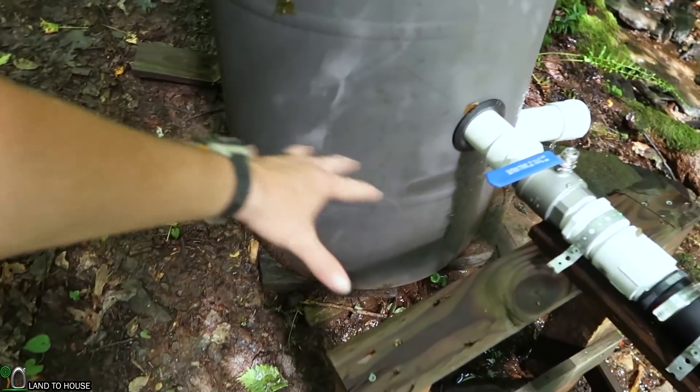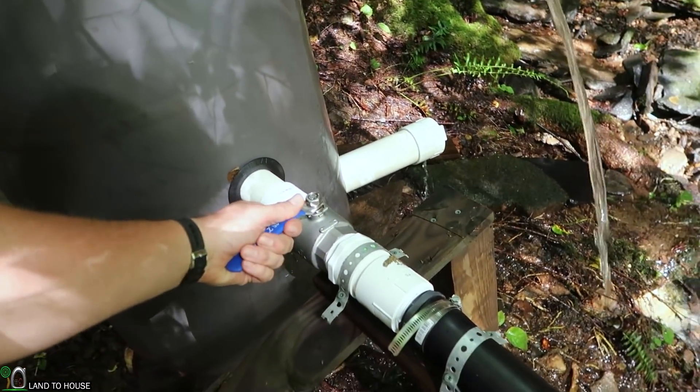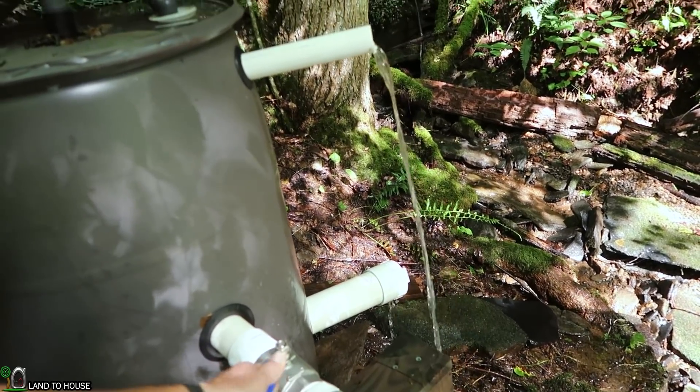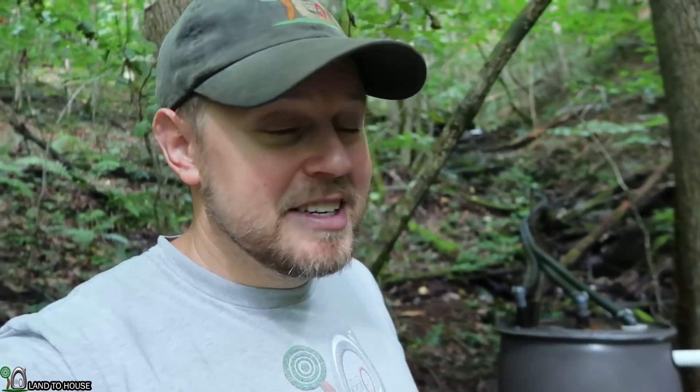After one month of use with some pretty heavy rains, the silt and sediment issue is not very bad here. I did look into the barrel when it was empty and could see just some sediment resting around in there, but it was not bad. So let's go ahead and open this back up and get our water going again. At some point in the future, I'm going to be replacing one of my nozzles with probably a 3/16 nozzle, because currently my single quarter-inch jet is pulling somewhere around 12 to 12.5 gallons a minute at the turbine. If I've got 29 gallons coming in here, I could easily use more water at the turbine, make more power, and life would be good all the way around. So that is something to look forward to in the future.